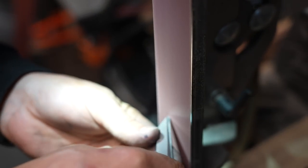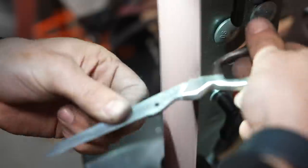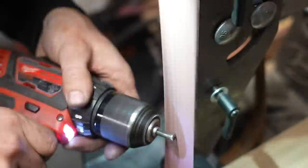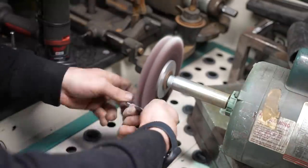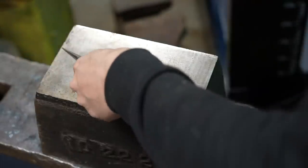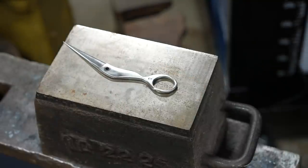Once that was done, there was a little bit of material on the front and I could do just a tiny bit of shaping on the front end of the scissor. At this point I still have a Phillips head screw in there and there's still a little bit of final shaping to be done, but these things are already sharp so I have to be very careful. For the bolt I have a nice little 10-32 Allen key bolt, and I custom shape the dome and custom cut it down so it'll fit nice. The last step is using soft Scotch-Brite style wheels on an open-end motor — this is a great way to get a unitized finish, and they're very soft so I can get into all those little nooks and crannies. Once that's done, the last thing is to add my touch mark, which is a little Z. I had left the handles soft so it popped in pretty nicely, and then I could clean up each of the halves and get this thing assembled.